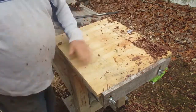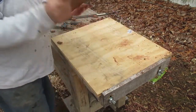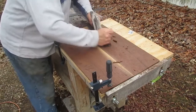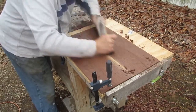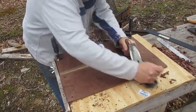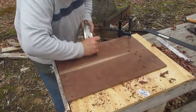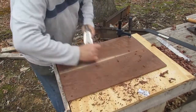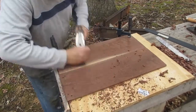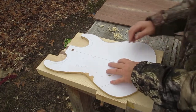You'll see me flipping it now because I'm going to be planing in the direction of the grain on one side, so I need to do that. And now to finish the rough thickness of this, I'll come across the grain, across the top. This is just a rough thicknessing because I still want room as I build to take it down to final dimension.